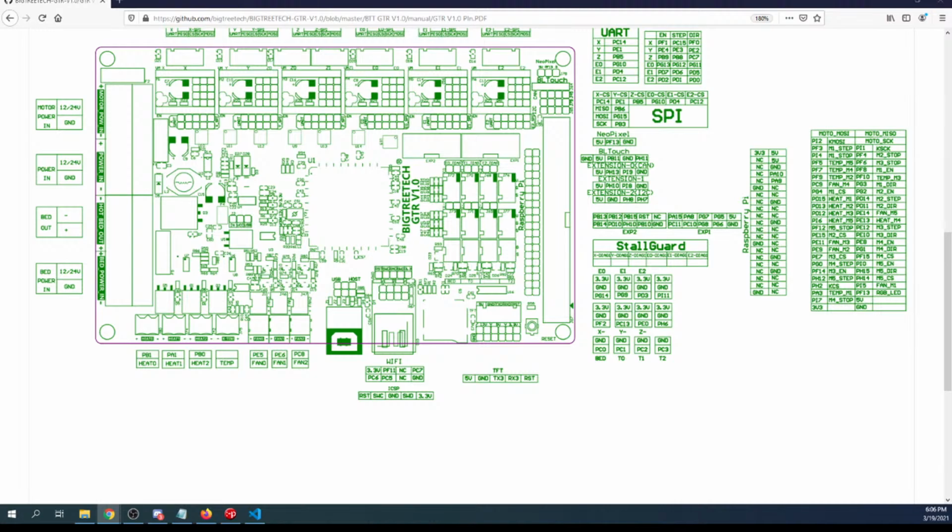Hi. I have had an experience with 0.9 degree steppers. A lot of people are having noise issues in the Stealth Chop with TMC drivers. I've done a lot of testing with the chopper timing for spread cycle. That's great. So you're getting noise in it. So I don't know if I have 0.9 degree steps that are labeled in my cache of steppers, but I can check and see if we can make it quieter. Which TMC drivers are you using?